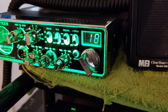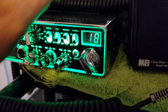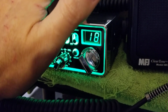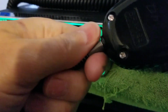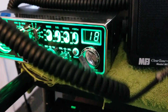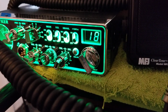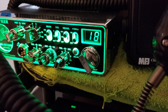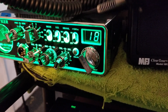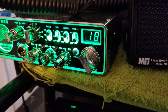Now, if you have a radio that a technician who knew what they were doing went in and modified the input of, sure, these SRAs are going to work good. You can't just throw a tone generator on your radio and keep upping the modulation to suit the Rangers, if it doesn't have the input response. The input response on the radio has got to be altered. A good technician is what's needed.